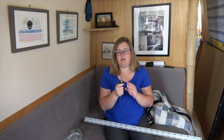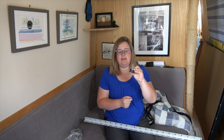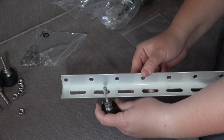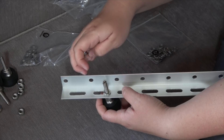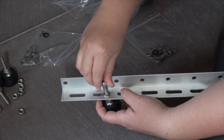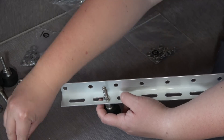There are different ways that you can attach the adjustable feet to your solar panel mounting bracket. I'm going to put washers on and then attach it with a nylon threaded nut on the top to hold it in place. You can put another nut in there which gives you a different height, which is good if your roof is more curved than ours.